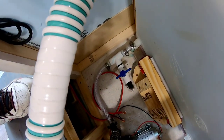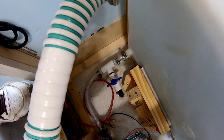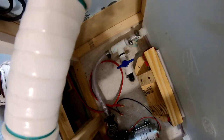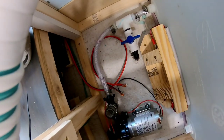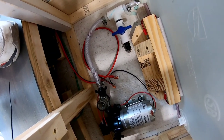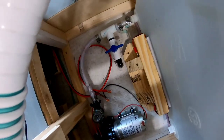I wanted to be able to have a drain. So the way I set up the drain is I put a T in the line right there and put a ball valve there, and it's going right down through the floor. So when we get ready to drain it, we'll be able to drain the tank real easily right there.